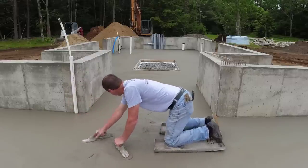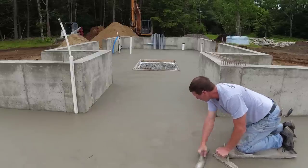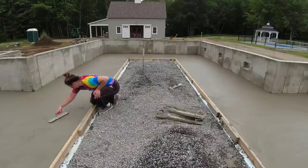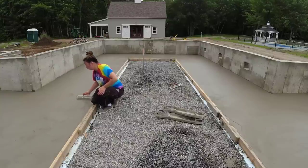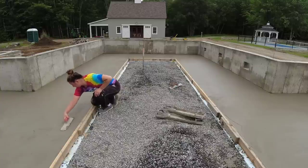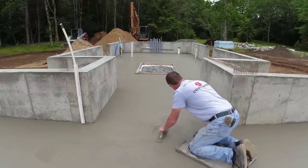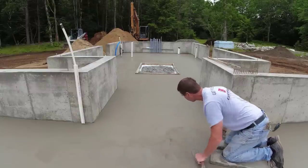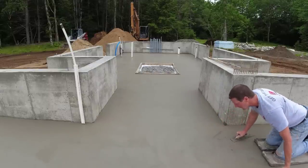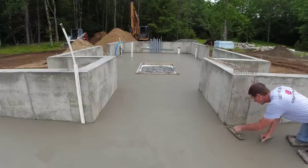The stuff did mag float out pretty good — I'm basically just going across it once or twice. The surface has some good paste to it, some good cream, so it fills in really nice. All the bleed water ended up drying up, so we don't worry about any bleed water. Tia went around that inside edge with the hand trowel and could reach quite a bit of it, which made troweling for me a lot faster. I ended up hitting it with the steel two to three times — you can see how smooth it is on the first hit, so you can imagine how much smoother it got each pass.